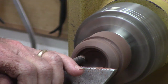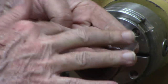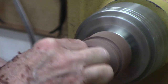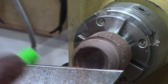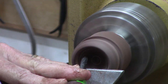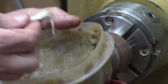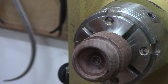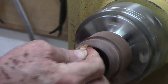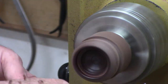Then I just kind of round over the corner where I've got a little lip inside. I'm going to put some sanding lubricant on some sandpaper, only going to about 220 or 240. After I finish, I'm going to use this point tool — just a couple of rings, no fancy embellishments. Now I'm using some homemade abrasive paste to do the final finishing of any scratches and polish. I probably won't put a finish on the inside of this box — this wax surface will be just fine.